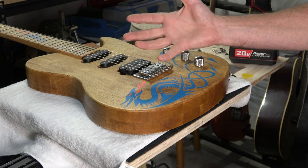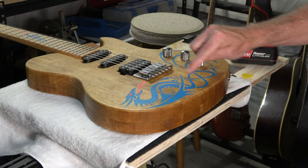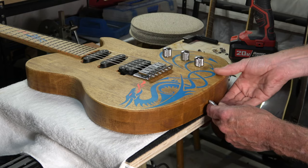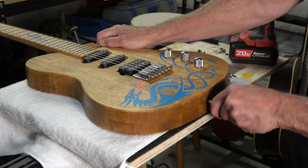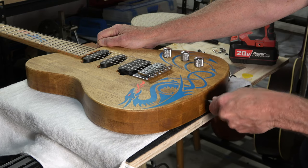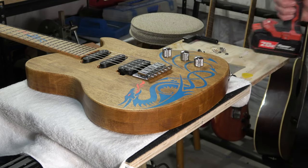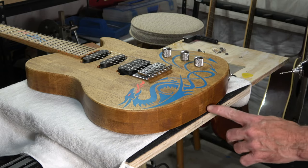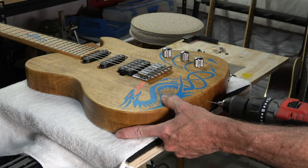It's a laminated piece, but it's all kind of a butcher block design, so I don't really have a center line to come off of. So I'll just come back here and then down to the glue line, and I'm just using a marking awl here, and I'll mark it with a little bit of a divot. And then I'm going to use this, about a 16th inch diameter drill bit, and I'm just going to drill a pilot hole straight back in here.